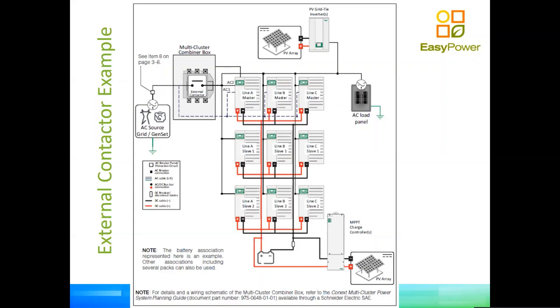Still, your MPPT charge controller will be able to contribute in this scenario when we're completely off-grid, because the inverter will not see the production of power out into this AC bus as an export. So it will just produce power from the charge controller for as much as required and necessary. So this is typically the type of installation that we do on commercial systems. So this could very well be a small hotel, a big restaurant, or a big office, right, 60 kilowatts.